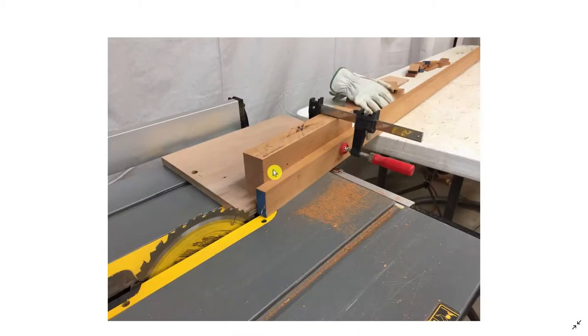This is the jig I used on my table saw to cut the scarf joints — the same one I used when I cut the scarf joints in the motor stringers and the keel. Since the boards are only an inch and a half wide, you don't need to cut partway through and flip it. You can do it all in one pass, though the guards are off the saw blade, so you have to be really careful. I've got sliders that fit in the slot on the underside of the board, with a piece of stock attached, and then I just clamp the piece I'm cutting.